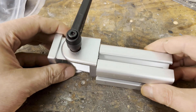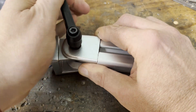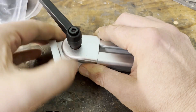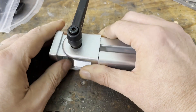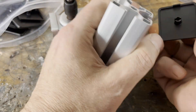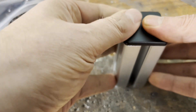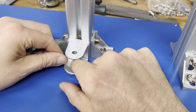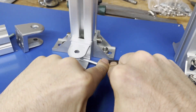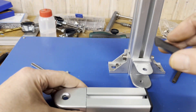The various accessories for the 4040 extrusion also include the hinge shown here. The hinge was then screwed onto the 500 mm long extrusion, which I had meanwhile also mounted on the base plate. I covered the top of the 100 mm long extrusion with self-adhesive foam rubber tape.